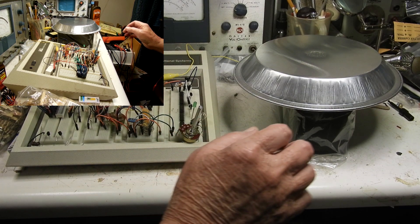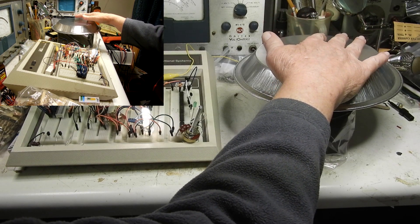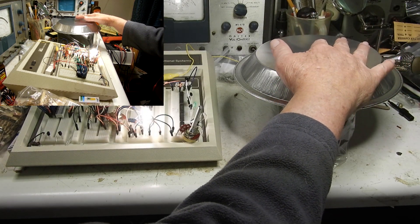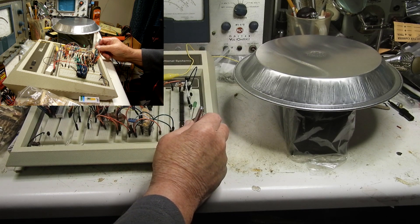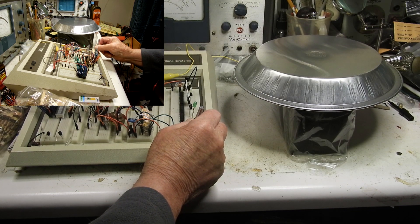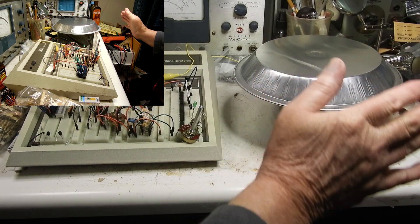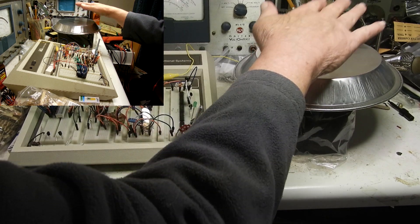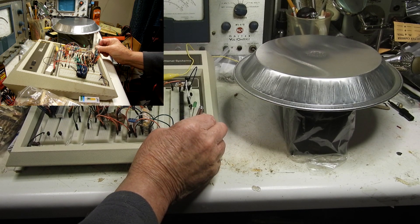The pi plate is our antenna. Bringing my hand close to it, you can see we've got pretty good control. I'm going to make it a little more sensitive — in fact it's already picking me up. See, it's getting a little brighter. Move my hand away, and now I'm quite a bit farther away and it's still picking me up. I'm pretty happy with this circuit. This is the 50k variable resistor for adjustment.